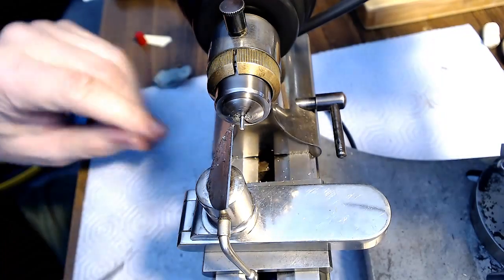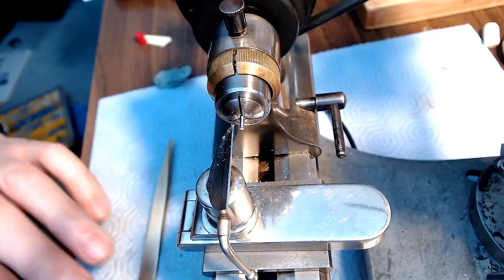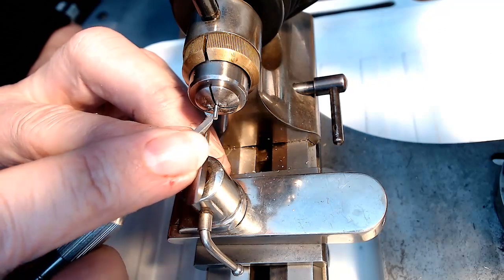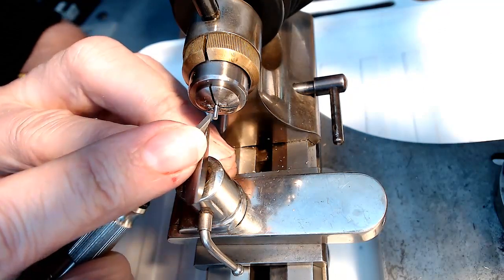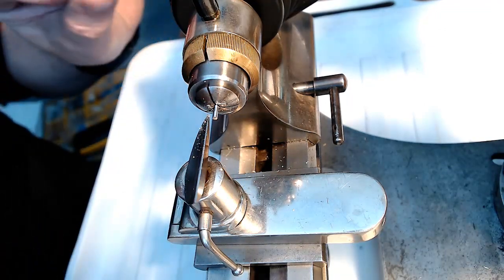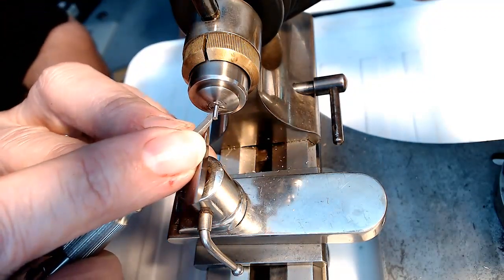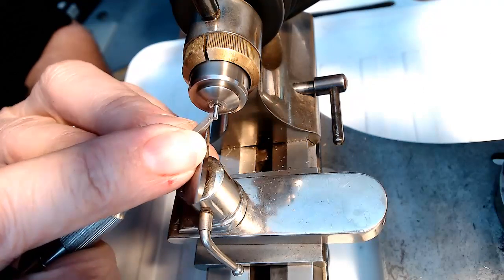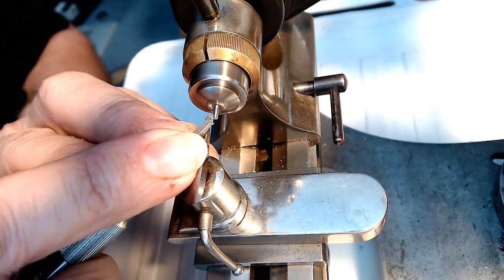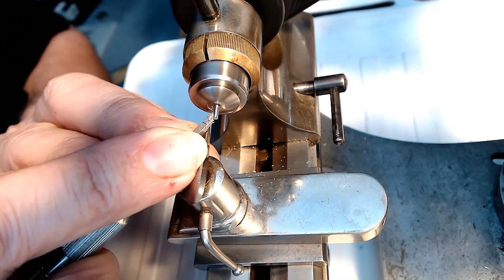But for the sake of the mess, I need to put a little bit of a pad under here so I don't have metal all over the place. There, I've got a pad under there, and I'm just going to work away on this thing to cut the metal down to the right size. Oh, I'll take this safety thing off the end here. This is a device that's used to make sure that you've got 90 degrees when you're making balance staffs or stems. So I'm going to work the metal down on the end here first, and I'll come back when it's down to almost nothing.